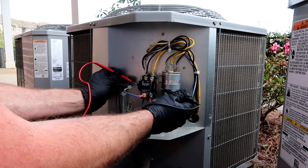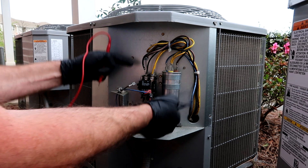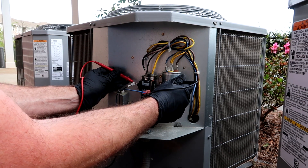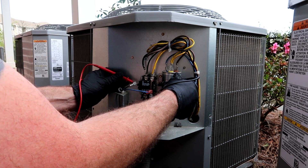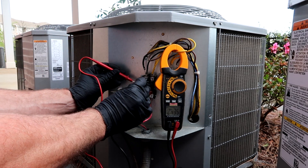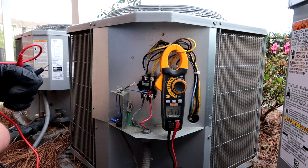One lead on one side of the contactor and one lead on the other. For you new folks — the sides are the low voltage and the top and bottom are the high voltage, so that's 120 or 240 volts. The sides are low voltage, 24 volts. I'm touching both sides and reading 1.13 ohms — that's a bad contactor. Touching both sides again — 1.1. That is a bad contactor. I brought a new one; let's test that.